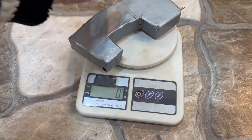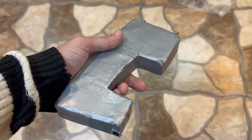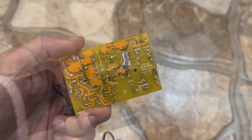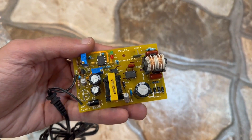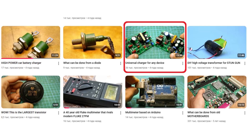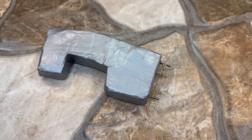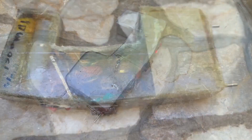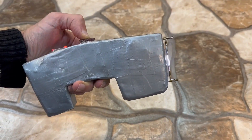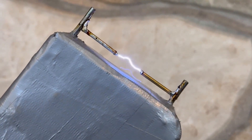This thing weighs quite a bit. Surprisingly, it also works. The shocker can be charged from any DC power source with a voltage of 8.4 volts, with a charging current of no more than 1 to 1.5 amperes. How to make a universal charger with current and voltage stabilization for lithium batteries — I have already explained in another video; the link is in the description. Of course, in terms of practicality this device is not great — it's heavy and bulky. It is suitable for self-defense, but as mentioned at the beginning, this video is created purely for informational purposes. I strongly advise against assembling and using this device as it may lead to legal issues. That's all from me — don't forget to rate this video, share it on social media, and check out the description for more details. This was KazinovK — until next time, bye.